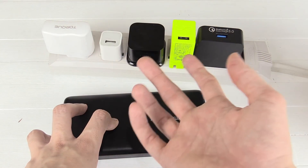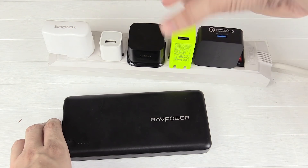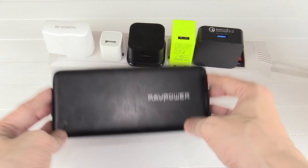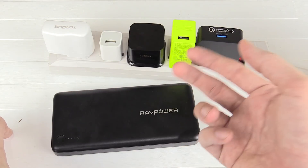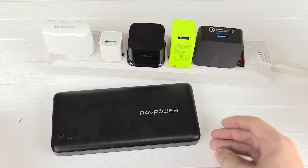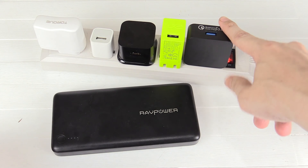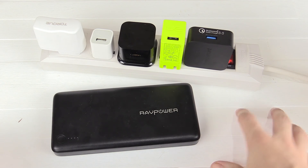If you have a very slow charger that can only output half an amp, it's going to take much longer to charge your phone or power bank than a bigger charger outputting 2 amp. When picking a charger, make sure you choose a high-capacity one. Even if your cell phone can only take 1 amp, still go for the 2 amp option in case you buy a power bank that supports it or upgrade in the future. There are so many people asking me why their phone or power bank takes so long to charge, and it's usually because they're using a low output charger. So I hope this helps. Stay tuned for a big giveaway featuring these Tronsmart chargers. If you enjoyed this video, please give a thumbs up and subscribe.